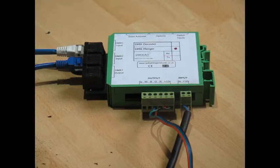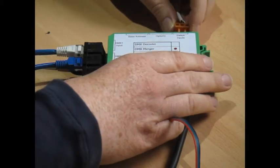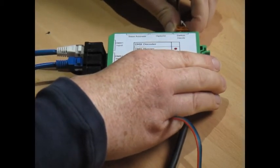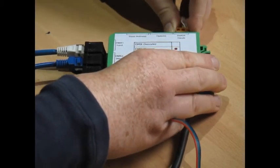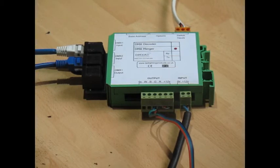On the switch input I'm going to connect a three position retractive switch, which you can get from us or your local electrical wholesaler. This is an optional extra that gives the user the option of a simple on/off wall switch. Alternatively, this can be connected to an occupancy sensor.